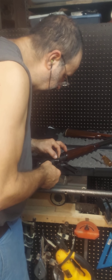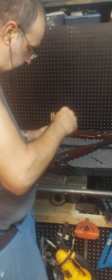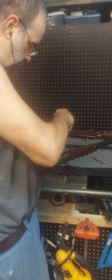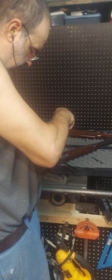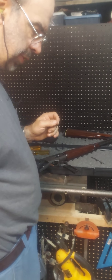I got the bolt pretty far back, it's going. These are not too difficult to take apart. The other screws are for the loading gate. There's no screw on the other side - I haven't figured that out yet. At some point, when I think I've got this fixed, I'll probably use anti-seize compound on all the moving mechanisms, or take a little molybdenum disulfide grease, mix with some gun oil, thicken it up a little bit, and put it on everything.